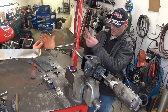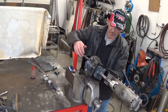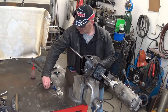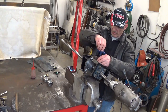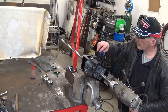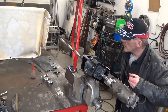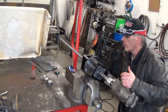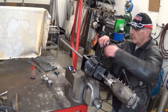I've got something round here — let's see if I can get that up in the corner. It's basically a copy of an A tool bit. We'll get our set screw in there. First thing we'll try to do is get this out roughly to the bore — bring it just inside the existing bore. Now this one is not out of round because it's something I bored in there today. So we'll just push it out to the level of the edge there and snug up our set screw.